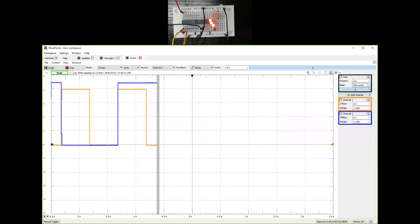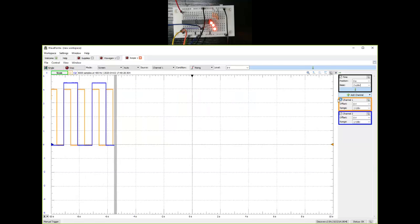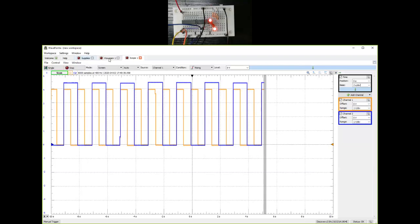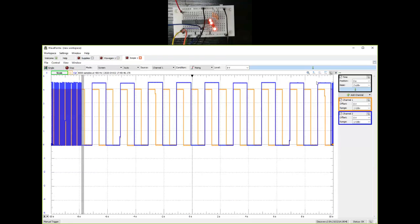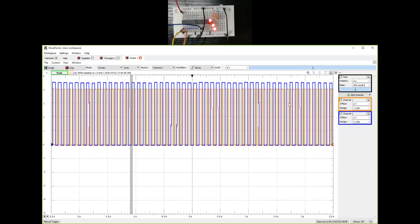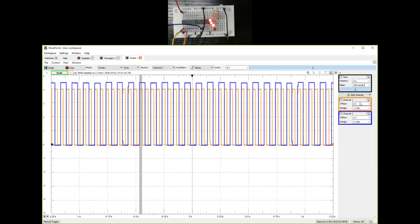So if I do this, I have a few more, 2 seconds perhaps. 2 seconds is, oh, I see. My frequency is too slow. I need this to be 20 hertz. So I'm going to go back, change it to 20 hertz because that's what we are expected to do. Come back to scope and it is now too much. So let's go back and look at this. This is plenty. This is actually 100 pulses almost. So 250 milliseconds per division actually should give me 50 clock cycles over here.